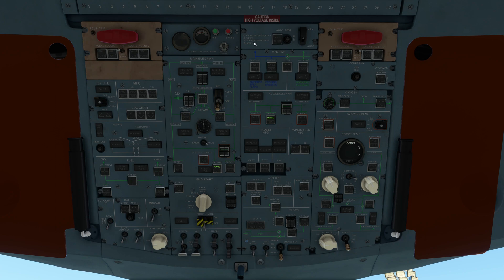Moving to the center-right, we have our audio test equipment. Under that is the blue and green hydraulic system. Under that is our AC power with AC buses and AC generators — it says AC wild because it's not restricted to a certain frequency; it's a fluctuating frequency set of generators. Next down we have our probe heats for captain, standby, and first officer, and windshield heating beside that. Underneath is our anti-ice: we have our props, mode select for icing conditions at negative 10 degrees or less, rudder and elevator anti-ice, side window anti-ice, and engine anti-ice with various temperature and mode select options. Most of that is not automatic — we just do the props. Haven't had to use the rest of it yet.